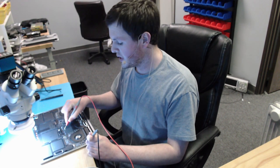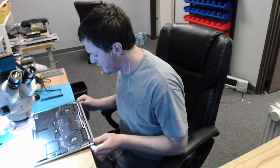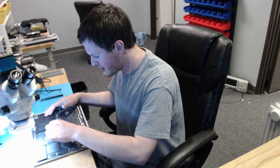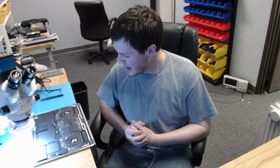We unplugged the battery and there is a 7.8 ohm short to ground on PPBus. At this point we need to pull the board out because we can't safely do anything with the board in the enclosure. We're going to give it another visual inspection on the other side, check for popped caps, and then inject voltage. We might have a CPU MOSFET issue so we'll start really low on voltage — like 1.3 volts or so.